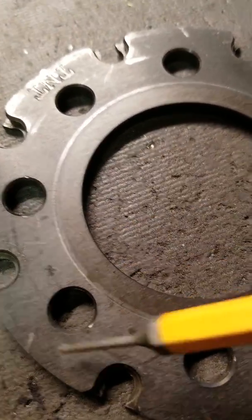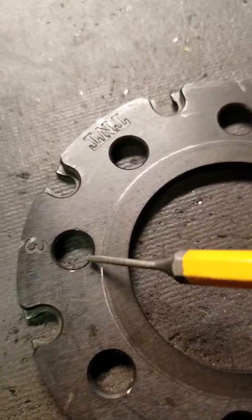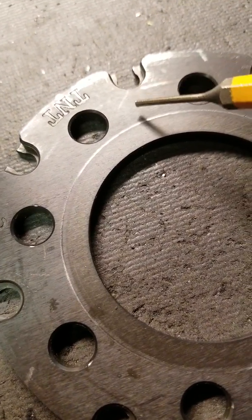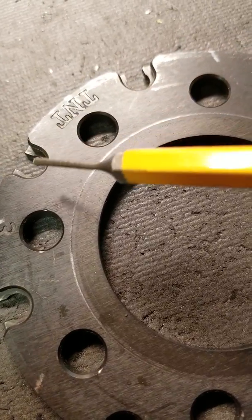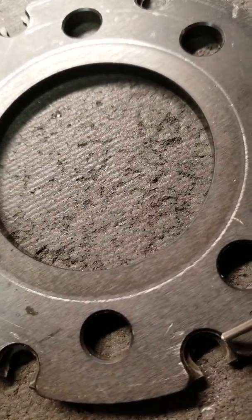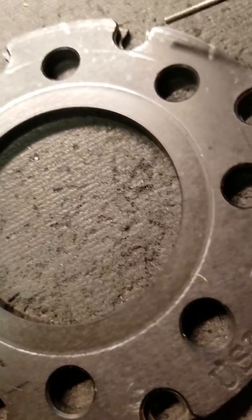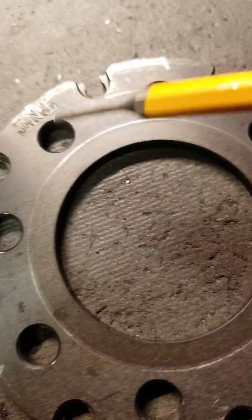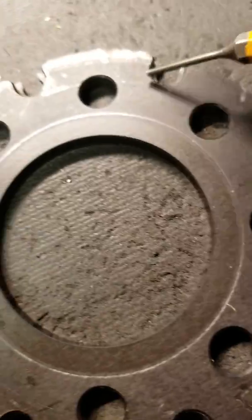This isn't warranty kind of work. This is, hey, you damaged this plate. After we did all the inspection and documented all the problems we found on the plate, we did go and run it. I have videos and pictures from before we ran it, just to show that all this damage existed prior to us running it. We went over and ran it on a rev2, at 2500 per hour, and had no issues feeding it at high speed, using Randon's plunger and an Amelbot spring underneath it. It was putting rounds right in the plate at 2500, feeding round after round — about 150 cases were in the bowl. It ran through and had no failures on any of the pockets anywhere. So this is really not a problem with the plate. The plate's doing its job. The machine it was set up on was absolutely set up incorrectly.